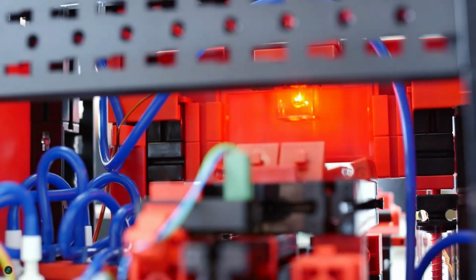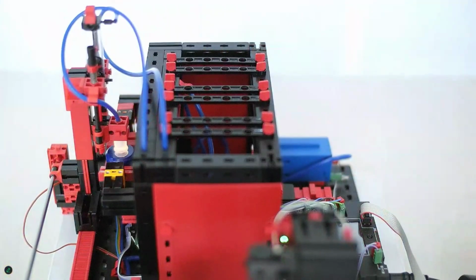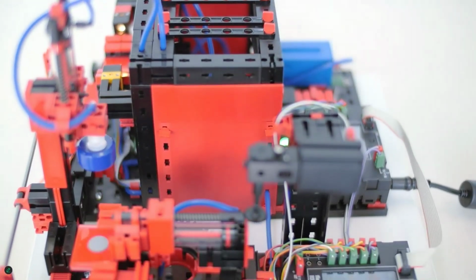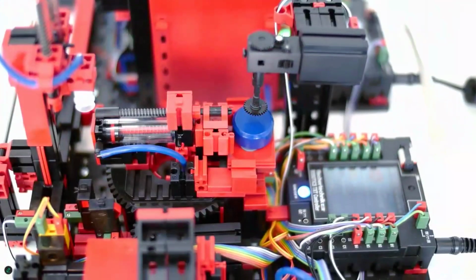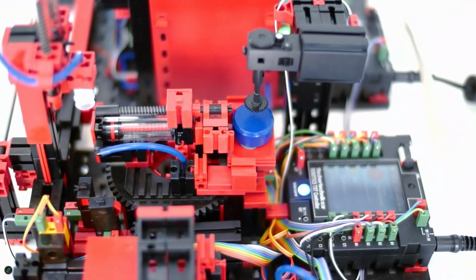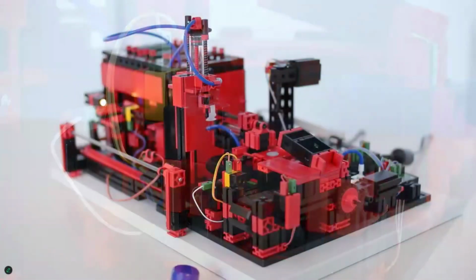Again, it's available in both a 24-volt version for use with the PLC of your choice, with once again a relay board for motor polarity reversal, both the multi-pin connector, again 34 pins with a grid of 2.54 millimeters, as well as additional PCB terminals with push-in connections for all inputs and outputs. And the 9-volt version in this case is connected to the 2 Robotics TXT controllers. So in this case, 2 120-volt power adapters are required for the operation.